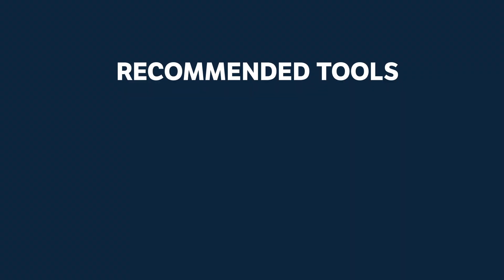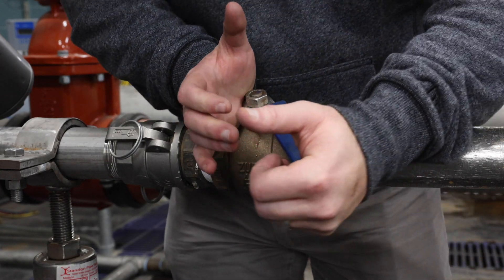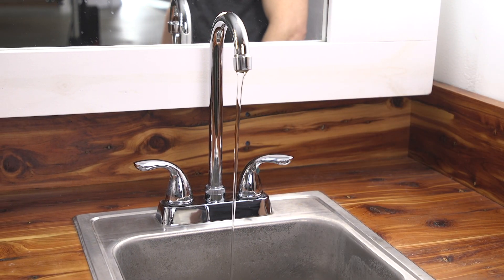All right then, here's how to inspect, clean, and replace or repair components of your 500 XL3. You'll need these tools. First, close the shutoff valve upstream of your 500 XL3 to turn off your water supply. Next, open a faucet downstream to remove the line pressure.